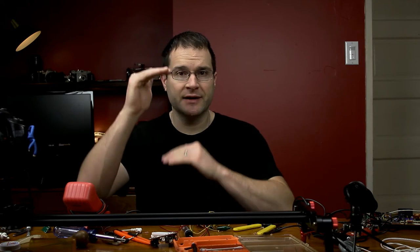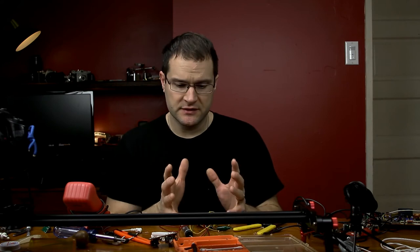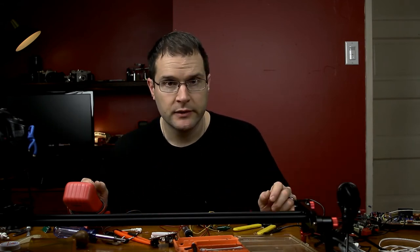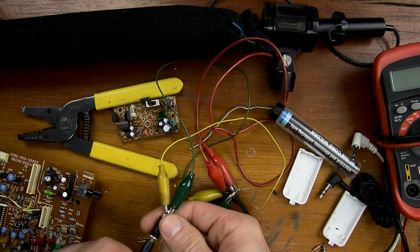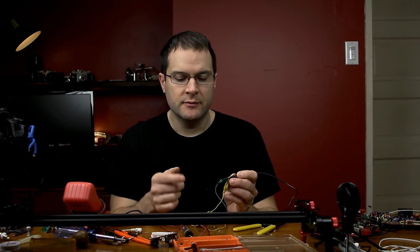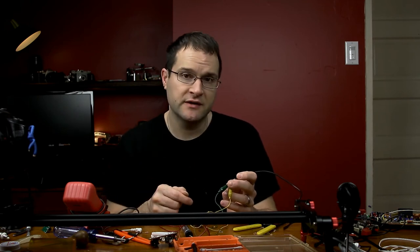The only thing that's gonna change is if you plug a different microphone in, you may not get the separation levels you want, so you gotta be careful. I'm using this specifically for this microphone and the RODE microphone, and as long as it works with those two I'm happy. It should work with the others too — that's part of testing. You can make a couple specific for each microphone if you want. I have a little mono 3.5 millimeter mono female jack so I can plug this microphone in and I'm testing wiring it up to that.